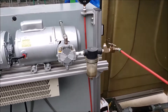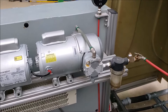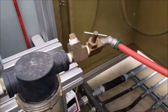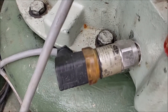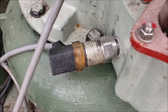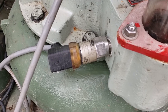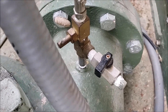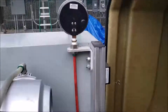The priming system we have on this EV style lift station is the Sonic Start Streamline. The basic thing is you have a vacuum pump, a little ball check, a needle valve that comes over to your solenoid, your little sight glass bubble, and then a little Sonic fitting that's basically like a little tuning fork on the inside that senses the water. The last part is a separate valve with a needle valve and a quarter-inch ball valve that goes up to your vacuum.